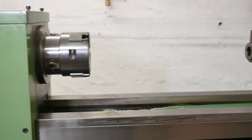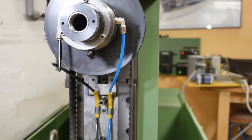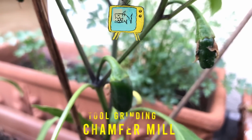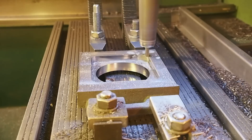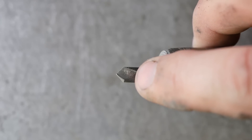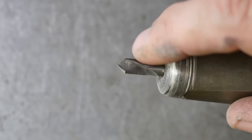G'day and welcome back to my channel where I'm working on modernizing this beautiful old 1980s Schaublin CNC lathe. Since I'm waiting for parts this week I think I'll do a little grinding job, make up a tool to fix something that's been bugging me. One of the nice things about a CNC mill is you can chamfer around the edges of all the parts quite easily, and for that I've just been using this six millimeter carbide center drill, but because it's only a small diameter and two flutes it takes forever to go around the parts.